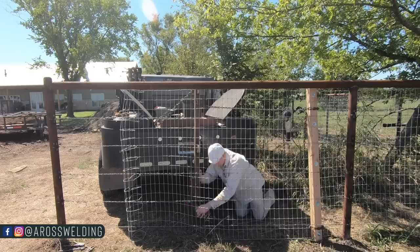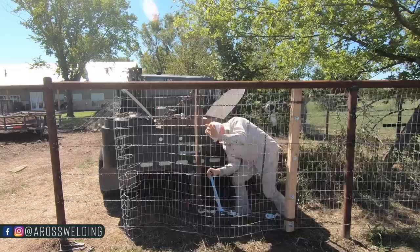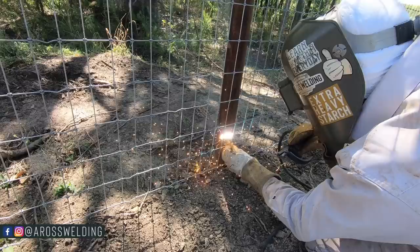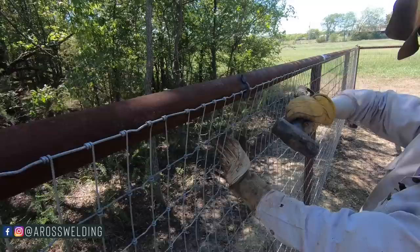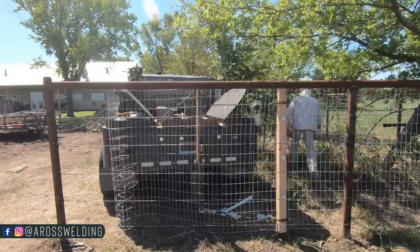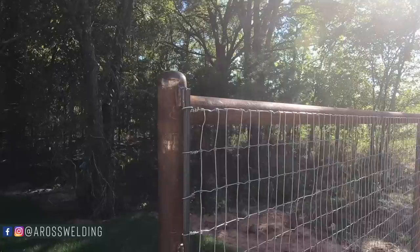We actually stretched it three different times. Once we got our corner pieces welded in, we went roughly to the middle of the longest section — there's a 130-foot section of main posts and top rail. We put our board on, stretched it, welded our clips on, and the clips held the wire tight up to that point. Then we moved our board down one more time, clamped the wire, stretched it, welded our clips on again, then moved the two-by-fours down one final time and stretched it to the very end. It turned out pretty nice in my opinion.